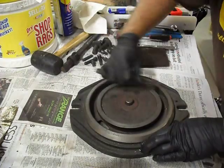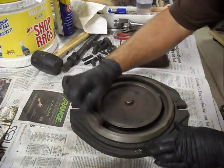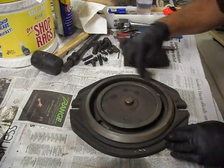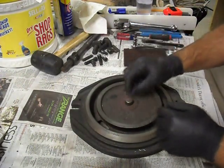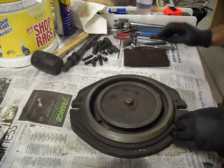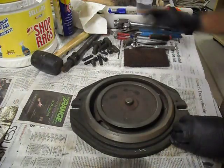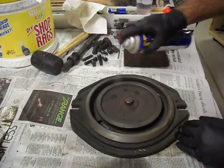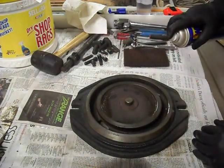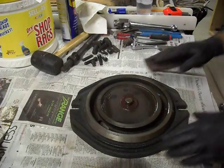Alright, last piece. This is the rotary base for the vise here. And not all vises come with this, and not all people decide to use them. But I find it quite handy. For the simple fact is I have a fairly small shop and a small table, so it allows me to pivot the vise off to the side when I'm not using it, and keep the pedestrian pathway clear.